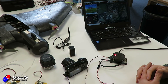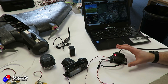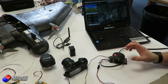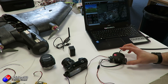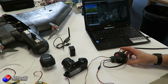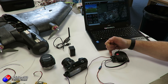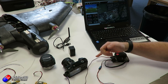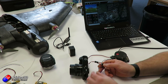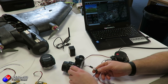In this video I'll show you how to trigger a camera using Pixhawk and how to test that it is all working. What we have here is the Pixhawk 2 flight controller. I've done the initial calibration to get it into a state where it's happy to arm, and we've got a connection here. I'm using main output 7 which is connected to my camera trigger.